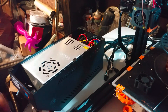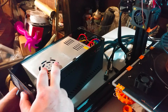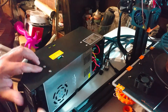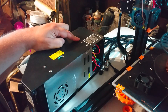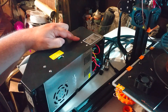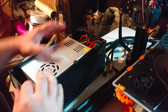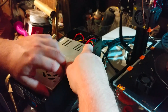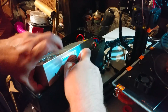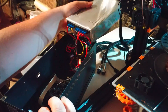I'm going to replace those screws with cap screws because they are garbage. The power supply just floats here with these four screws, so my next step is to remove those. The kit comes with all the tools you need. The power supply is now unscrewed and will lift out of the printer. You have to stretch it a little to get it past this tab, and since it's still connected you don't want to damage it, so just pull it out carefully.